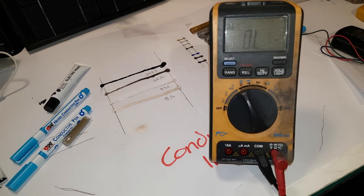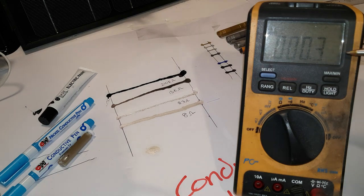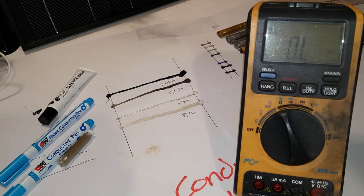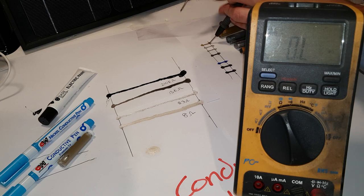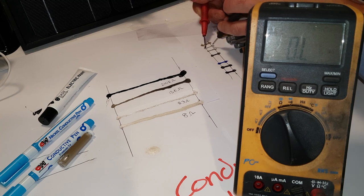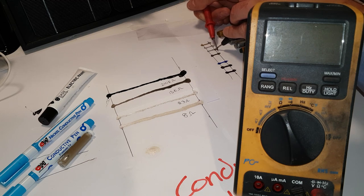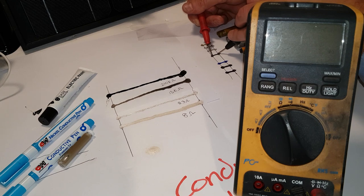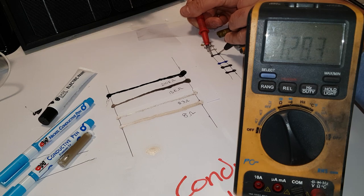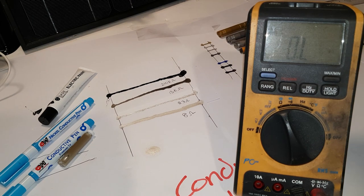I should also include the internal resistance of the multimeter - it's coming up at about 0.3 of an ohm. This is the first non-conductive ink, but it is a metallic ink anyway - and there is nothing there, no conductivity, lots of resistivity. Nothing from that one. Let's go down to the next one. Nothing from that one either - they're all nothing. Just checking the probes are still functioning - yes they are. What about the next one? There is something from this one - this one is about 120-180 ohms. That's nice. Oh, that's the pencil.